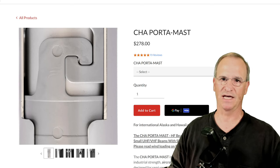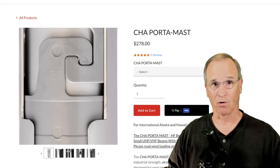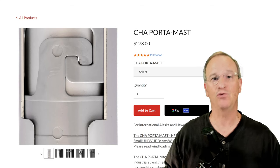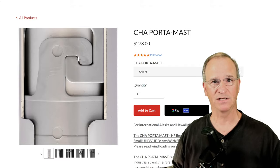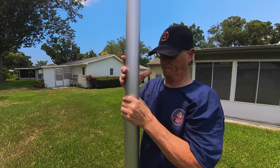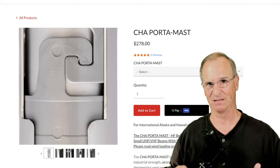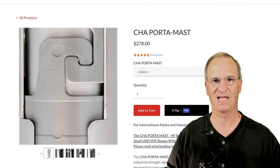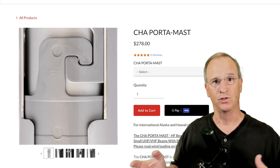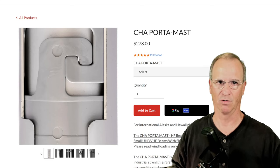The next trick is this: do not actually put your wire antenna in the ground or attach it to something else at ground level and then raise the mast. You can do that, and I do it here in this video, but it puts side tension on the mast as you raise it up. As you get to that top section it becomes a little bit more difficult to engage. I've done it here successfully, but I've done it both ways — with no tension on the wire and with tension on the wire — and I found it to be easier with no tension on the wire.